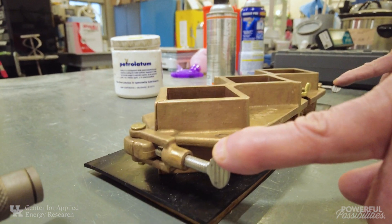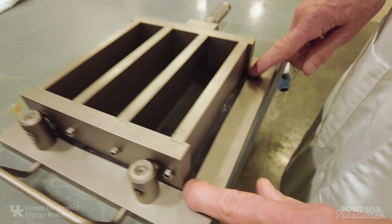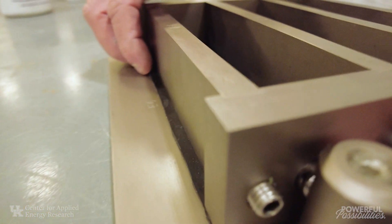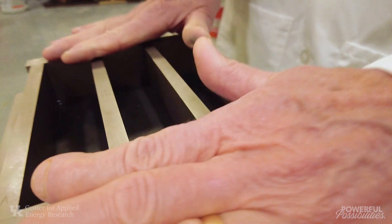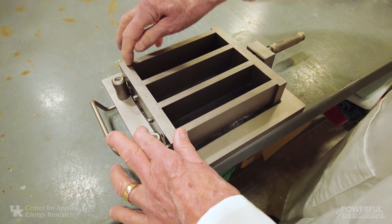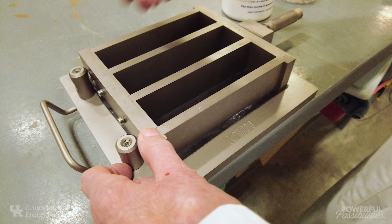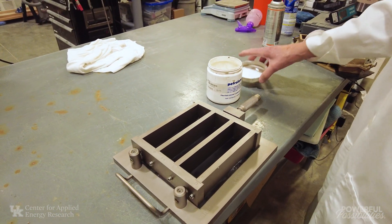We also replace the brass screws with stainless steel — it keeps them from mushing up and preserves mold life. On this particular kind of mold, you can't use an eighth inch; you have to use a sixteenth of an inch, again durometer 60 or above. The reason is you need to keep the register pins in at least some level of contact. We've tried a thirty-second-of-an-inch thick gasket, but it's too wrinkly. Also remember to grease these edges and the bottom with a little bit of Vaseline to keep water from seeping out.